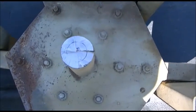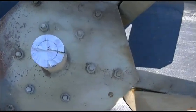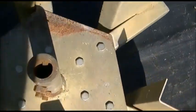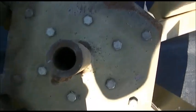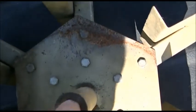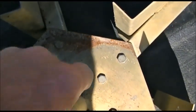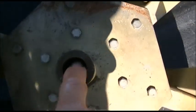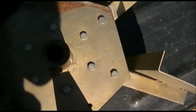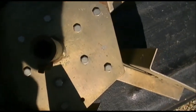Well, to my surprise, that's a solid bar — I figured it would be hollow, but it's not, it's solid. The other side is hollow, which means it is empty, and I figured that was probably not the case. So that means I can put a punch through there and drive that out, and that should be quick and easy.